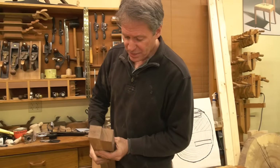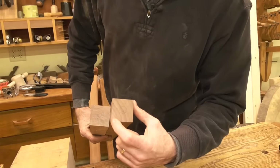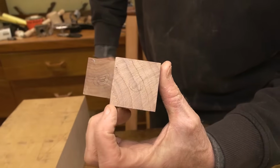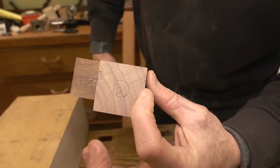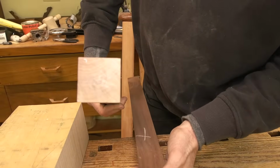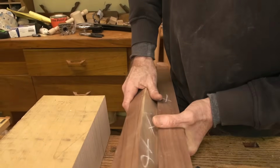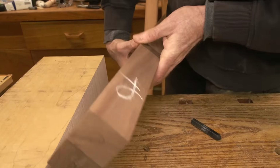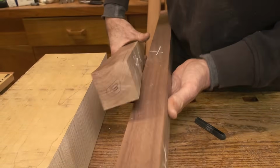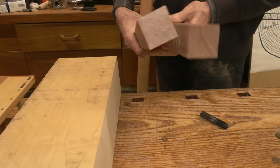This is just a couple pieces of walnut. Those numbers on the end don't mean anything, but look at the number of growth rings there. See how wide those are? There's 1, 2, 3, 4, 6, 7, 8. Yeah. Only 8 years in that piece. This one, I counted them earlier, it has 20. So the same species, it's so much better quality. I mean, this is passable. It would look beautiful, right? But it's just a little more blah in terms of the lines in it.